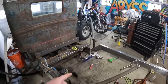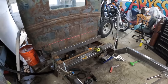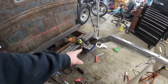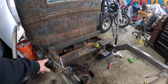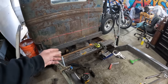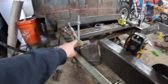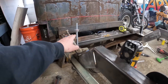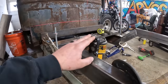And just to make sure, because I can't trust this body because it's dented, there is a half inch hole on both sides of the frame right there, which I know are in the same point because I measured off of the other rivets. They all came up with the same measurement. I went ahead, took half inch rod, threaded it in here, locked it down in place, used the nut and a washer as an adjustment point